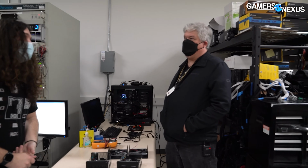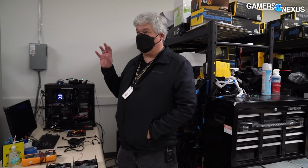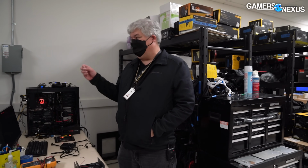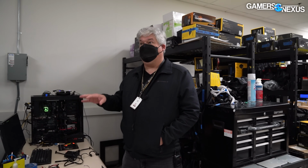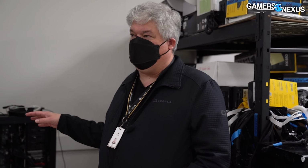It's really simple. If you really look at what 80 Plus is, and they've done a great job, being green is definitely a good thing. If it's more efficient, you're using less AC power to create DC power, so you're putting less strain on the grid. That's not a bad thing. The problem is when they test the power supplies, they test at room temperature, they're not looking at voltage regulation, they're not looking at ripple, they're not looking at all these other things that make a power supply good or bad. They're only looking at how much AC is converted to DC, and that's it.